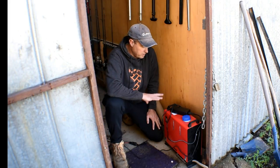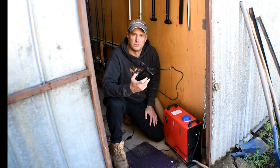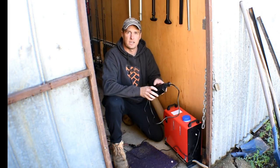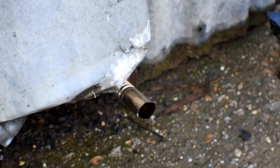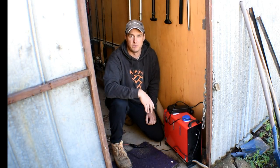Here's the second reason why I chose an all-in-one over a permanently fitted diesel heater, and it's probably the one I'll use the most over time — can we use it to heat a shed or a space like that? If you're going to use the diesel heater to heat a building shed like this, you're probably going to need a 240 to 12 volt transformer to power it, since it runs on 12 volts. And probably the most important part — make sure that the exhaust is pointed out of the building and away from the space to be heated so that you don't get carbon monoxide build-up.